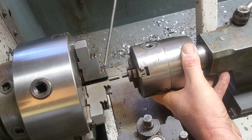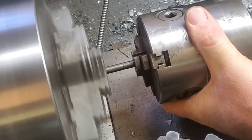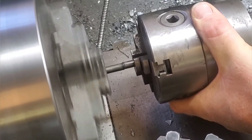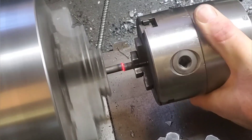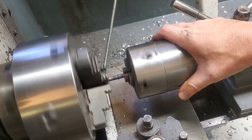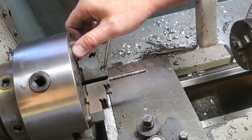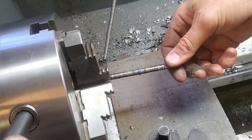Let's grab another piece of scrap and give it another whirl with a different strategy. This time we're going to do a bit of a warm-up phase — we're moving a little more towards success here, and in the end we do get success. Pay close attention to how it almost wants to take off every once in a while; that's because I'm increasing the friction and feeding it in a little bit on the tailstock. Now you'll see the bluing start to transmit through everything — this is what we're looking for. We want to preheat that. This weld didn't really come together as well as we'd like, but we'll figure out how to do it a little bit better next time. We definitely did get power to it because you can see a bit of slippage in the chuck. The warm-up cycle was actually lapping the faces of the two materials and not causing it to run off.